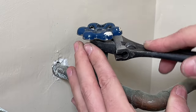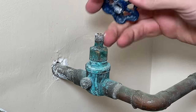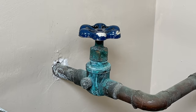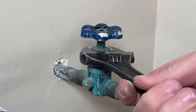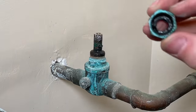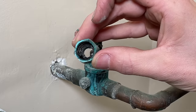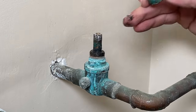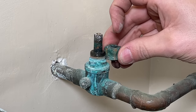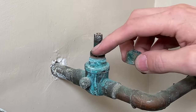Starting to get it to work free — and now that's worked free. You might need to keep this on to actually remove it, especially if you want to keep the valve closed while your water is still on — mine is not. Now we'll remove the actual packing nut keeping the valve closed. Looking down in that packing nut, I can see some remnants of probably graphite used over the years, but overall very little packing material remains — that's why I didn't see exposed threads.